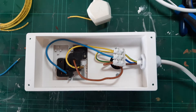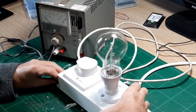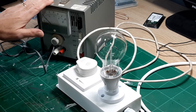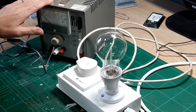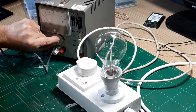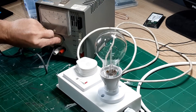It's safety first when it comes to dealing with mains — make sure everything is out of reach to the touch. It didn't take me long to do the wiring, just a few minutes, but I made sure that everything was connected as it should be and that all the earths were in place, just to ensure that the device under test has a pathway to earth if it needs it. So I've got my final tester built, it's on its base now, everything's sealed away in terms of the mains. I just want to do a quick test — I don't really have any vintage electronics to plug in; the closest I've got is my bench power supply. We'll turn that on — it's all plugged into the wall, so all I need to do is flip the main switch and you can see it is powered on, getting its normal power.